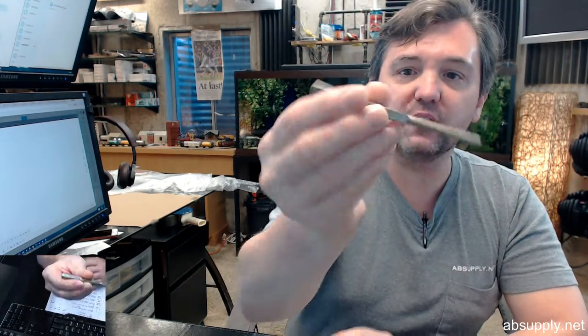A bit difficult to see the 260094, but look where it says upper bolt. You'll find it buried in the greater assembly of the actuator assembly, the strike assembly, and then the concealed vertical rod top rod assembly that's there. It's buried inside of there. So that's the bolt. And let me give you some dimensional properties. You might have one in your hand and you might not be sure if this is the right one. Well, the tape measure will help you be sure that it is.